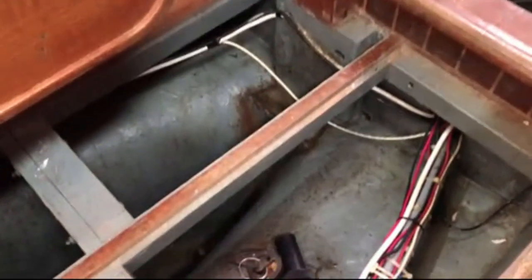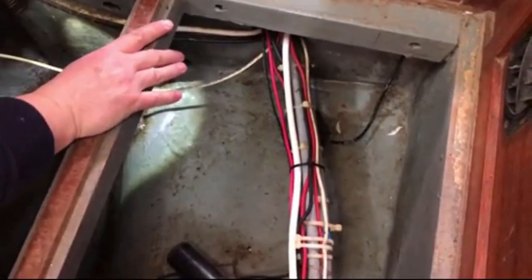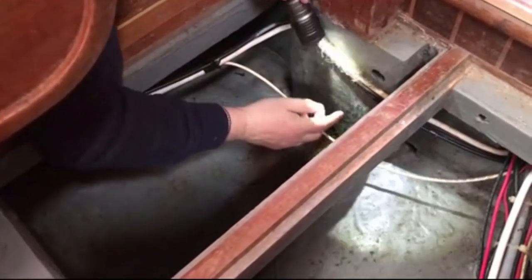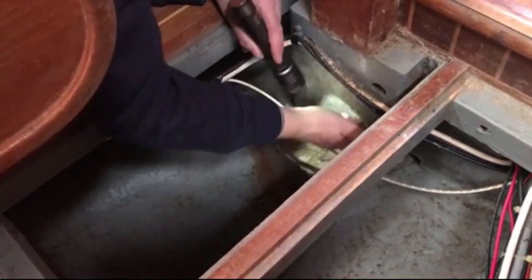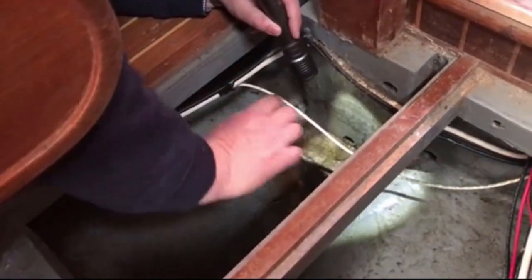There's a lot of water down there. The new depth sounder transducer is here, taking the place of the redundant one. One thing I've noticed is that there's quite a lot of water streaming down here, so the mast step is leaking. Water coming down — what you don't want is for this plinth to start decaying. You don't want this piece of wood to start rotting, and as you can see there's a lot of water here, so that needs to be cleaned away and kept dry.